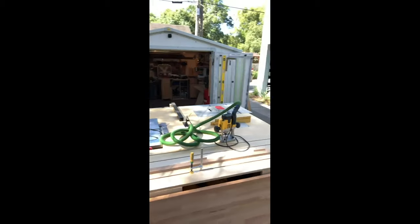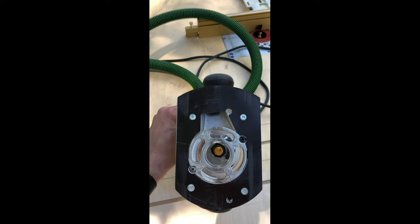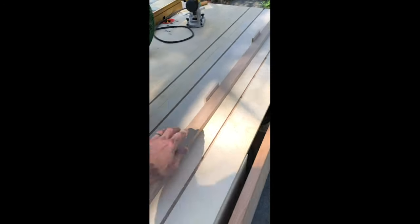It's a beautiful day and I've got lots of dovetail tracks to route. I want to show you a trick I learned about how to do these nicely. I measured the router base — it's symmetrical, so half that measurement is the center of my bit. I wanted four-inch spacing, so I cut this guide rail. Along with the guide rail, I cut these little wood pieces that fit snugly into the dovetail tracks — now I can register off the last dovetail track I cut. Once I've cut one, I put the key in and route the next one, and you just keep going down the line. Every subsequent track I route is going to be totally parallel and exactly equal spacing with the last one.